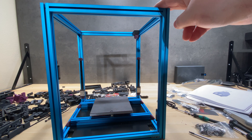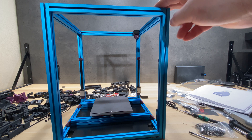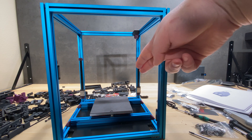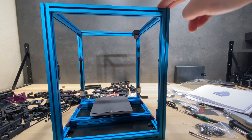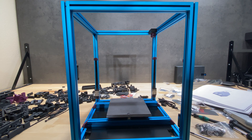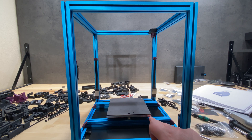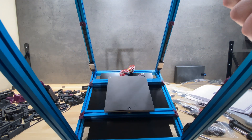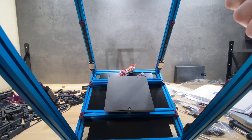If you've seen pictures of the Micron, this might look a bit odd. You'll notice the extrusions aren't in the usual direction — they're instead in this direction. This is a limitation of the kit by DFH. The current version of the Micron uses a mounting pattern similar to the Voron 2, with extrusions in the same direction and four mounting holes, though you're supposed to only populate three. The bed supplied with the kit is essentially just a Voron Zero bed.